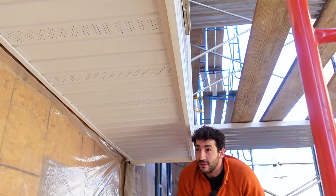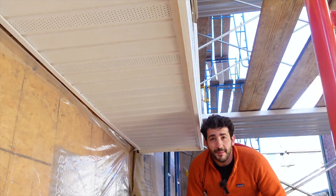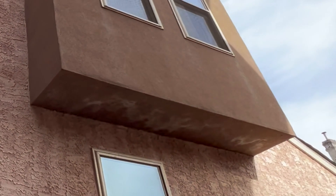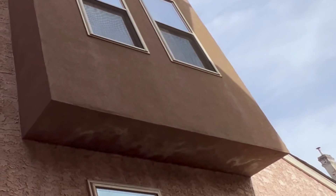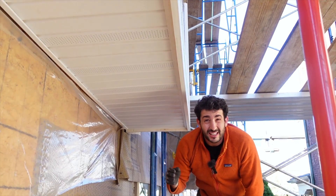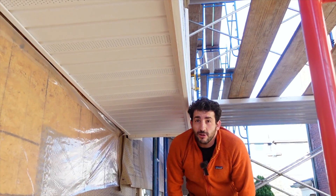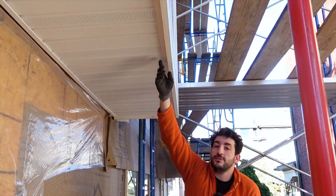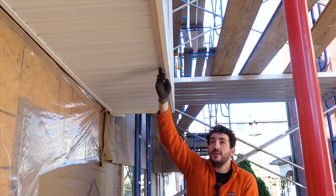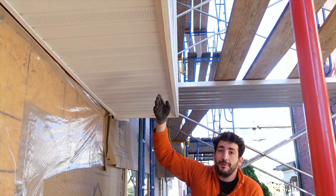We didn't have that. If you can see in these videos too, on the original stucco there are tons of signs that moisture wanted to come out. This white staining is called efflorescence — that's minerals being passed through a masonry system and the salts are actually getting deposited on the outside. This is usually an indication that there's moisture and moisture movement. Unfortunately, there was so much damage under the stucco system it wasn't letting enough out. So there should be a really clear weep system where one plane stops and the next starts, to let water out.